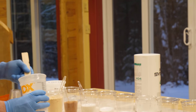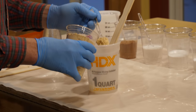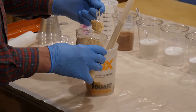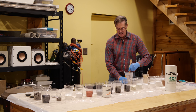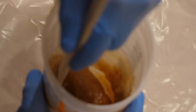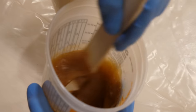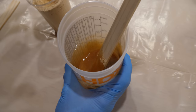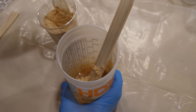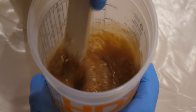Now we've given this about two minutes of mixing, and we're going to start adding the powder. I could give you ratios, but with wood being relatively inconsistent batch to batch in particle size and moisture content, the endpoint here is really the viscosity of the final mixture. Start by blending slowly at first so you don't get clouds of dust all over the room. Once you've got the material wet you can get a little more aggressive. Keep adding powder until we turn this into a runny peanut butter — something between peanut butter and yogurt. You're going to get hungry by the time we're done.